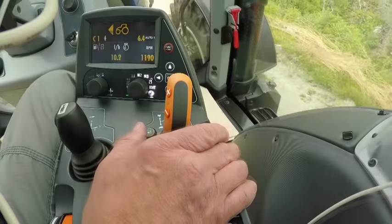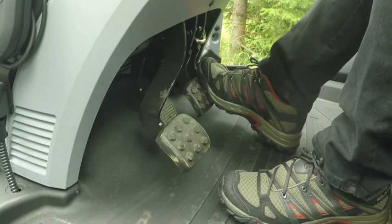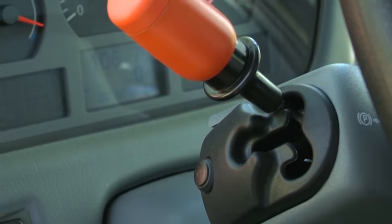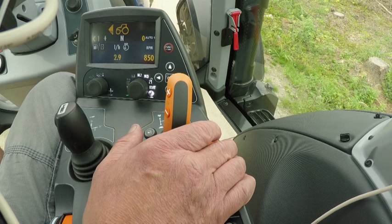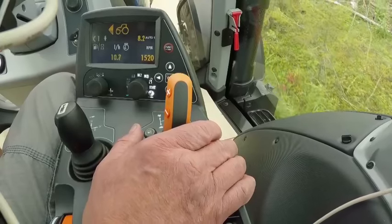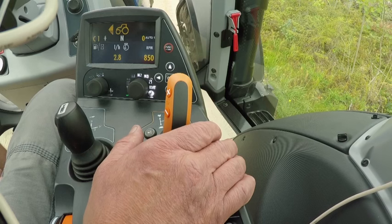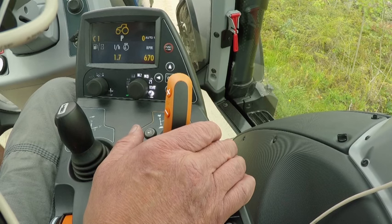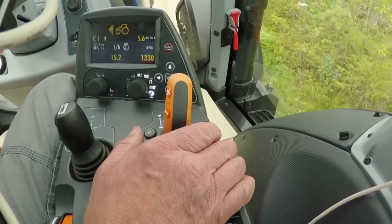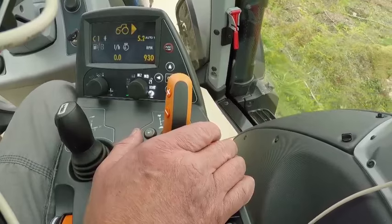Another very practical feature in Versu tractors is hill hold. For example, if we want to stop in the middle of a steep hill, just push the brake pedals to stop the tractor. Keep the brake pedals pushed and apply the parking brake with the shuttle lever. Put the shuttle lever back to forwards, keeping your foot on the brake pedals, and then release the brake pedal. This way the park brake stays on and you can start to drive again by simply pushing the accelerator — the tractor will pull away smoothly without rolling backwards. This function is very good for any transport work or other jobs where you need to stop often, especially on steep hills or slopes.